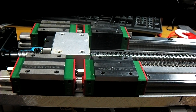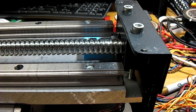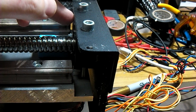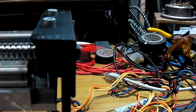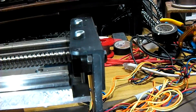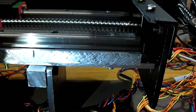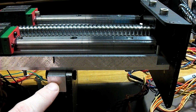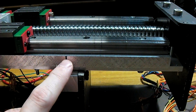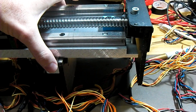The more you start putting these together, the more things and choices that are going to make it difficult come out to bite you. On the bottom side the bearing block is bolted to this steel, and underneath the steel this is aluminium. The aluminium had the corner rounded so that it fits flush in there. The back mounting points here are both for actually mounting to the gantry. The lower mount just uses a square bit of aluminium which runs the full length, drilled out in locations to attach this plate and to attach onto the actual Z-axis, with the idea being to not protrude and hit the gantry too much.